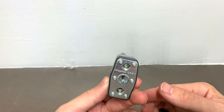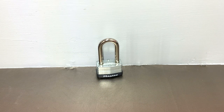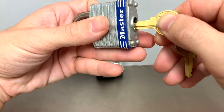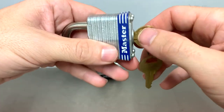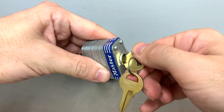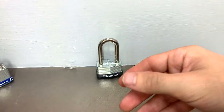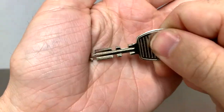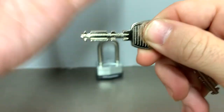Your normal lock pick kit isn't really going to help you out here. Before I show you how we pick it open, let me explain how it works. With a pin tumbler lock, when you insert the key it pushes these pins upwards until the top pins and bottom pins align at a shear line, allowing you to turn the core over. With a warded lock, the key looks a lot different — it's got these notches cut out, perfectly squared off, not angled in any way.